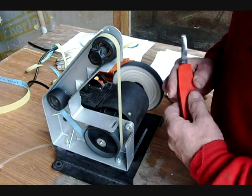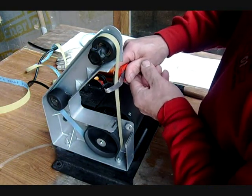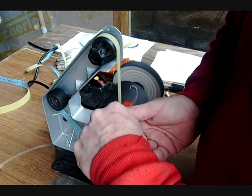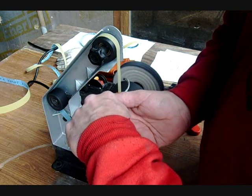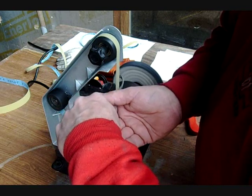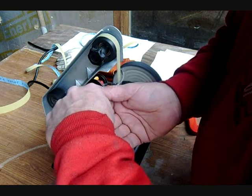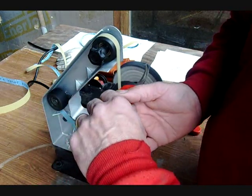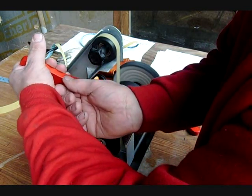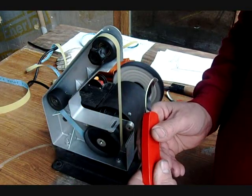Another way of doing it, now this is a right-handed knife. So obviously you're coming from this other side. You can also do it away from the edge. If you are worried about being safe, it's safer to do it upside down so that your belt is never in danger of hooking into your knife edge and ripping. You can do the hook the same way. Come in from the top. Do it lightly. Check it and see how you're doing.